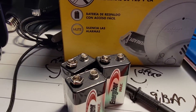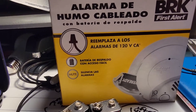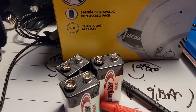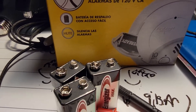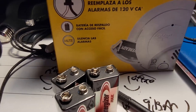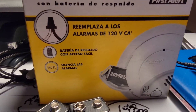I tested all the circuits — it's on its own dedicated circuit — and everything was testing out fine. I also changed the plug that's hardwired to make sure it was getting a good connection. What happened is one of the batteries failed and jumped way up in voltage, putting so much voltage through the smoke alarm that it acted radically and the board got fried. You can't power these without a battery — if the battery fails inside the unit, it'll take the unit out. The board failed on my other unit.